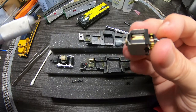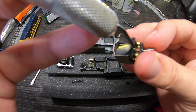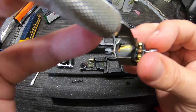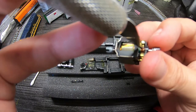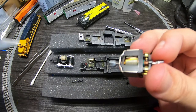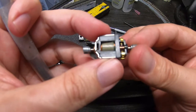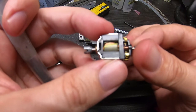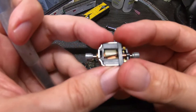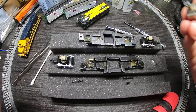All right, three-pole motor so we've got three divides here. Don't go digging this thing in here like you're looking for the Ark of the Covenant — the movements need to be very gentle if you are going to use a hobby knife to try to clean your commutator grooves.